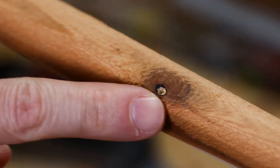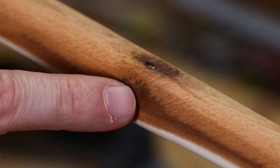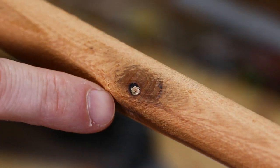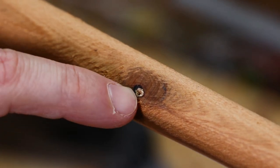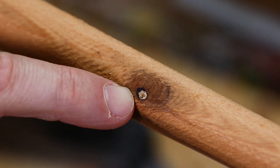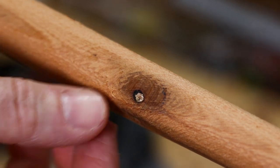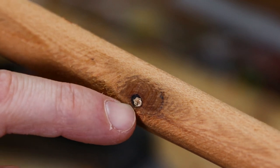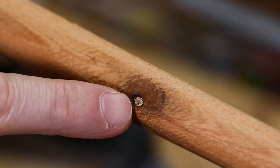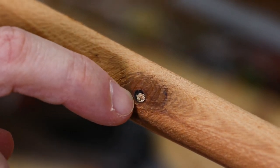I'm fairly confident through experience that this one will disappear — I can't guarantee it, but I'm fairly sure it will. The one that causes me concern, the one we're going to look at, is this one here. You can see this is much bigger. I've started to leave an area of wood around it because I want to strengthen that area, but the other thing I'm going to need to do is deal with the actual knot and the potential of it collapsing in on itself. You can probably see more clearly on this one the very creamy inside area, which is the soft pithiness.